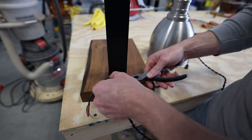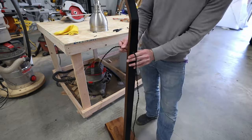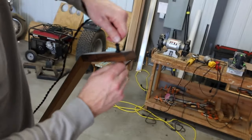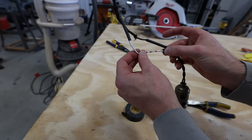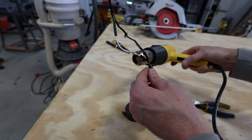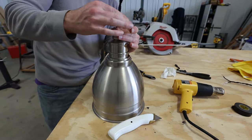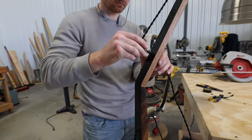The wire was a bit snug to initially get through the exit hole, but once the braided wire passed through, it started to move smoothly. The wire will transition up the back, through the middle, and then up over the top before being dropped down. The wiring was connected using Sopobe's solder seal wire connectors — a waterproof joint that contains solder in the center. You evenly apply heat and it seals as well as melts the solder. I applied a shrink tube over the top for extra protection. A tensioner is installed on the top of the shade to prevent the weight from pulling on the wire connectors below it. Now I will pull the wire to the desired length and find the proper tension across the top.